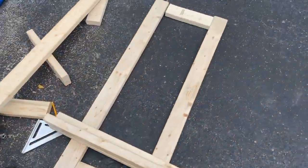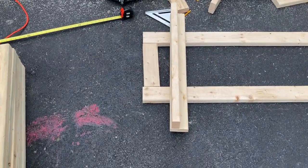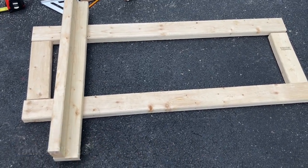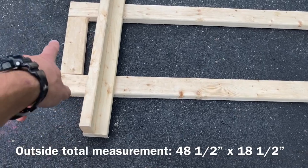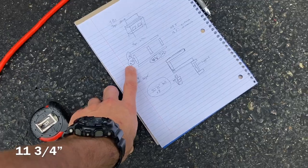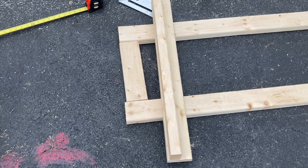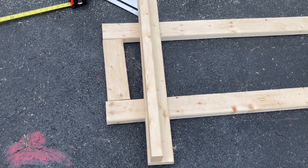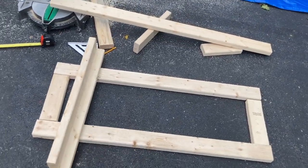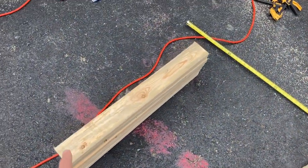Here's how the frame's gonna be on the top. We're gonna bring the tank down tall ways and then all the support. The tank is 48 by 18, so we're gonna go 48 and a half inches by 18 and a half inches, and the middle cut is 11 and three-quarters inches. That 11 and three-quarter inch plus the wood — two-by-fours are actually three and a half by one and a half inches, not actually two by four. So we made two cuts of 48 and a half and two cuts at 11 and three-quarters.